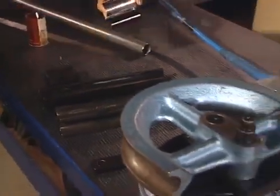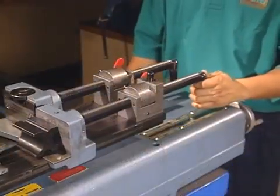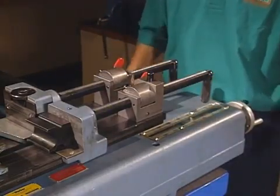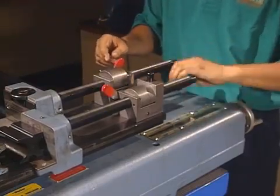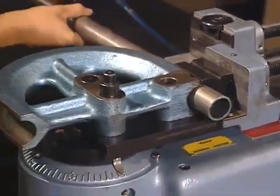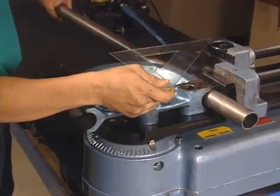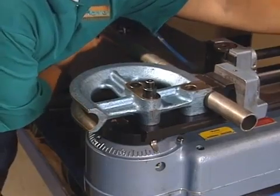Place the clamp block in its vise — it's held in place magnetically. The vise screws for the clamp and slide block feature a rapid positioning feature: pull the cam lock mechanism to disengage, push the screw forward, and re-engage by pushing the cam lock forward. Now position the tube: place the tube in the clamp block so your mark is lined up with the desired degree mark on the radius block. Using a triangle can help you get more accurate results. This method of positioning is the same whether your bend is 45, 90, or 180 degrees.